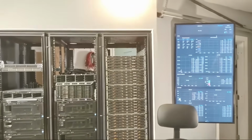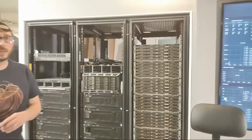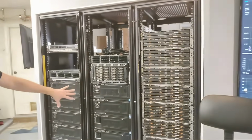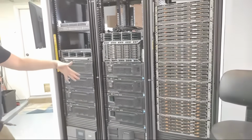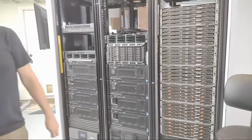Probably create a Proxmox cluster for most of them. And I'll probably even put the R920s and R930s in the Proxmox cluster. Maybe. I don't know. I'm a little bit meh on it. But just not have them be part of the quorum. You can actually do that in your config. That way you won't have a problem starting or stopping if 8 machines are off, because that would definitely affect your quorum. One more.